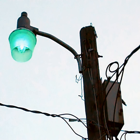Metal halide. A very closely related lamp design called the metal halide lamp uses various compounds in an amalgam with the mercury. Sodium iodide and scandium iodide are commonly in use. These lamps can produce much better quality light without resorting to phosphors.